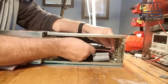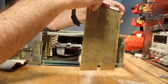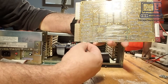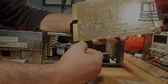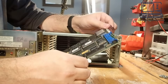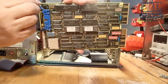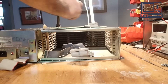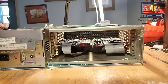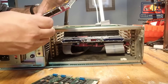The next two cards serve as the controller subsystem that manages the storage devices stored in the front of the chassis. The first is an RQDX3 controller, which connects to the hard disk, an RD-53 — basically a 72-megabyte full-height hard drive. The second board is a TKQ50, which serves as the controller for the TK50 tape drive, which is a DLT drive. After a quick blowout with canned air, it was time to put things back together. Reassembly of the chassis is very simple — just putting the cards back in and making sure they seat into the backplane securely. The guides on either side of the cage help enormously to keep the cards going in straight.